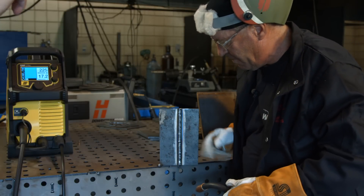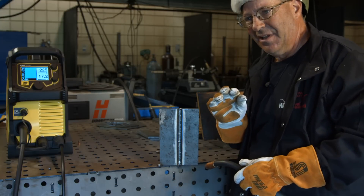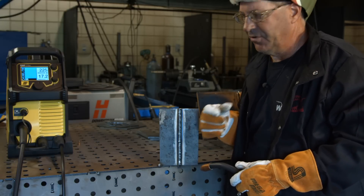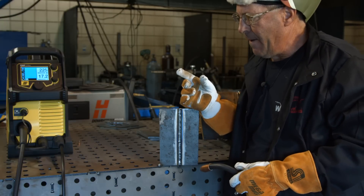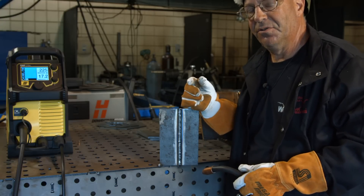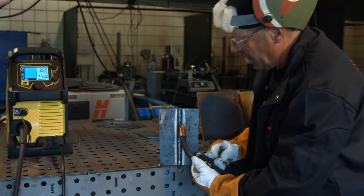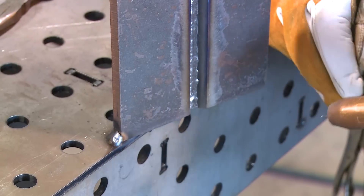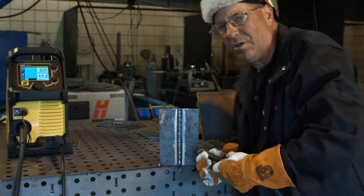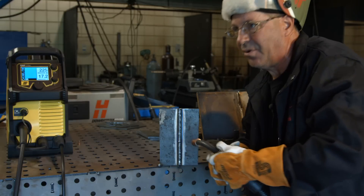Our root pass went in okay. I've buffed the glass out with a wire bead brush. One thing I noticed — I don't quite have the reinforcement on the back side; however, it is fused, just a little bit flat. To take care of that I would probably reduce my voltage down to 17.0 and reduce the inductance, so it has more of a freezing effect on the weld pool. I had my wire pointed uphill on the leading edge. Now I'm going to point it straight in or downhill five degrees while going up, keeping the wire on clean weld metal. I'll start at the bottom and run up about two-thirds to three-fourths of the way.